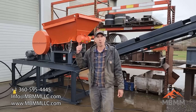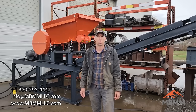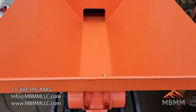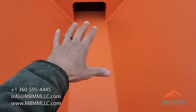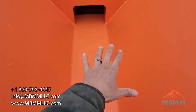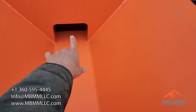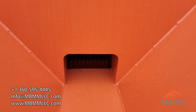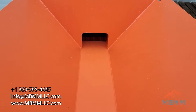Here's a look from above looking down into the vibrating hopper for the jaw crusher module. You can fill this hopper completely up — it will take about a half to three quarters of a yard. As it vibrates, the material flows down through that hole. Once the material drops off that little lip there, it goes right into the jaw crusher, and the jaw crusher will crush it down and feed it onto the conveyor.